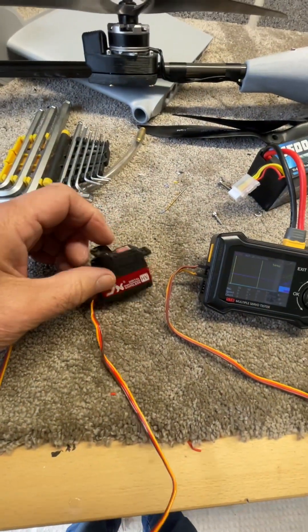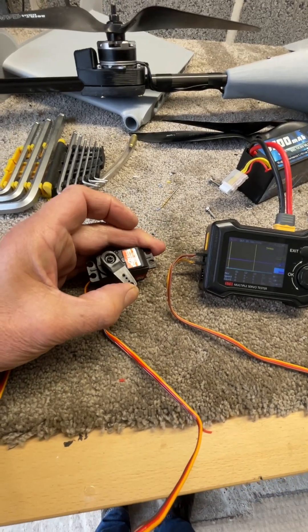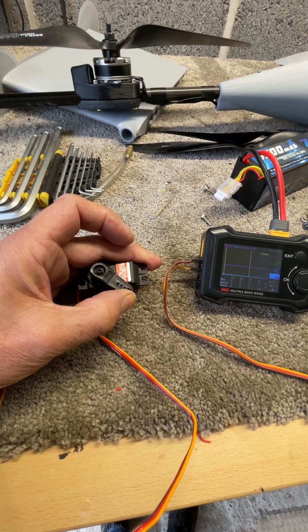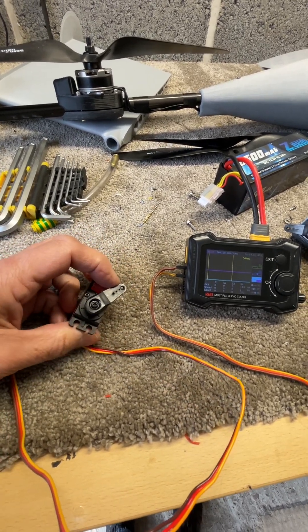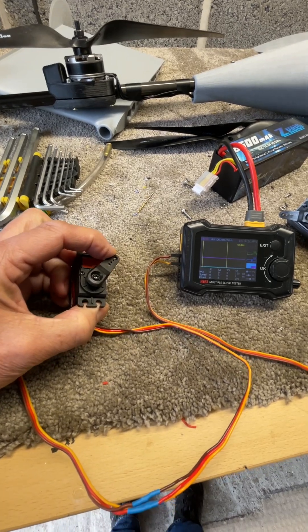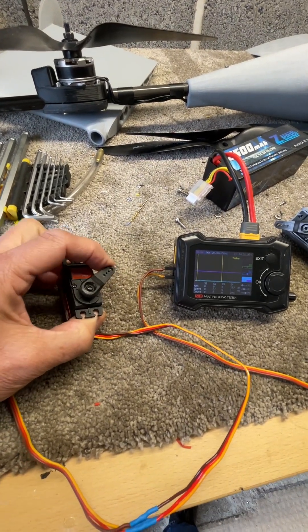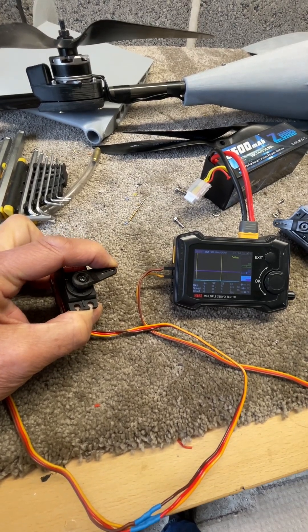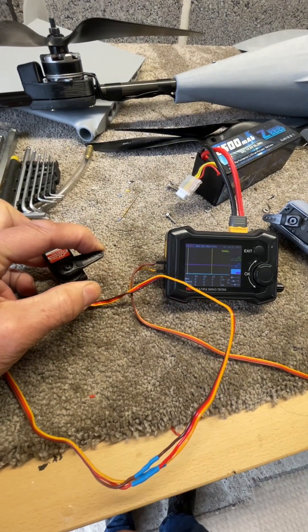The other thing I've noticed is that the original failing servo is very stiff, but only if you try to push it fast. It moves quite freely if you push it slowly. To me that's like when the outputs of a motor get shorted — the motor inside is trying to turn really fast with the high gearing. I think basically the motor outputs have ended up shorted.